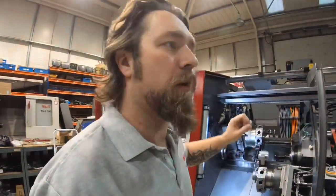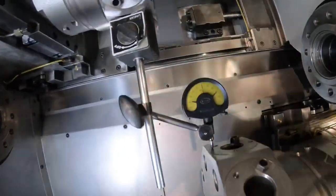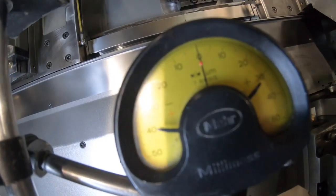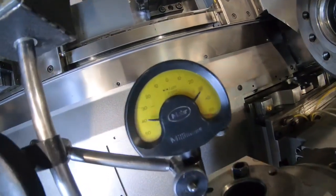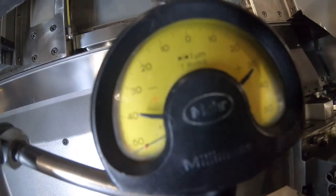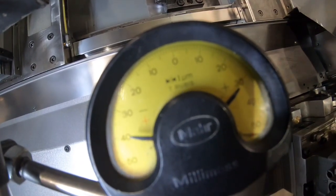We have got new ball screws on there, or refurbished depending on whether they were repaired or not. Everything's been checked, so every ball screw I've zeroed out all the backlash tolerances. I've got the plunge clock set up on $1 and $2 for the X-axis travel. First in the program is the G0 rapid — as you can see, I've just wound on in the same direction and we're on zero. I'm going to cycle start from that position, moving 0.1 rapid back and 0.1 the other way back to reset. As you can see, I'm just under one micron, so we've entered one more micron into the electronic backlash and the program is repeating — everything's honing in nicely. That's the principles of the backlash shown.